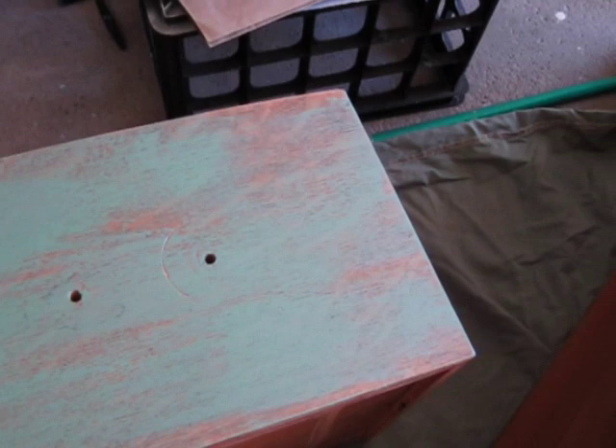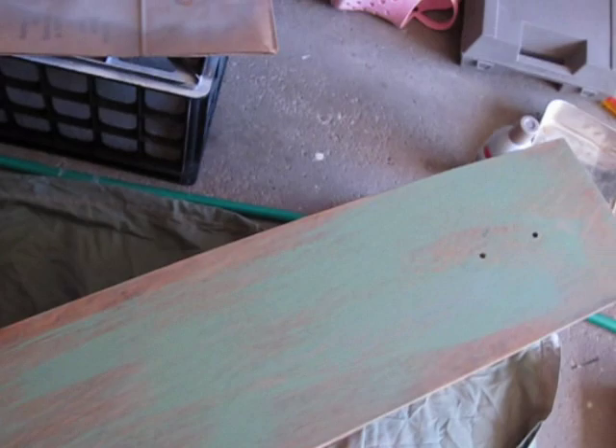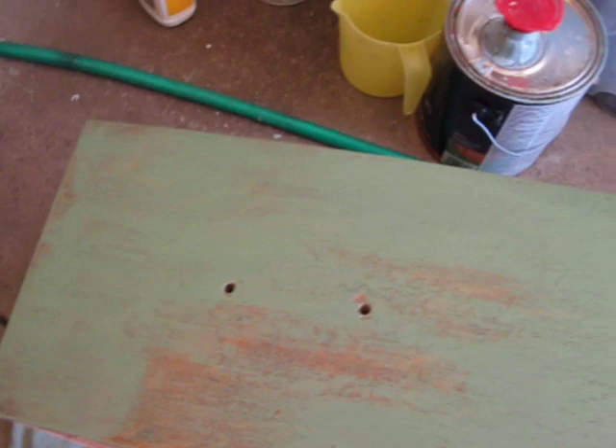Those are all the pieces so far, and I'm going to let this dry for a little bit, and then I'm going to come out and give it a light sanding with about a 180 grit sanding block - about a medium grit - and sand off some of this again, and then water my paint down and put another coat on. I might get really fun and add a little bit of blue to it, just for funsies. It's the thrill of how it might turn out, knowing it might turn out really stupid looking - but then I'll have it documented. I refinish furniture by the seat of my pants.